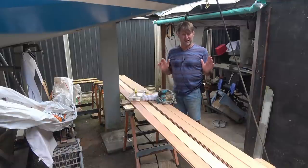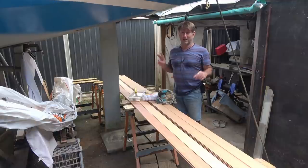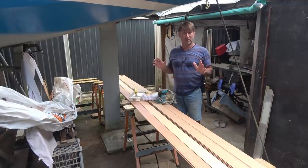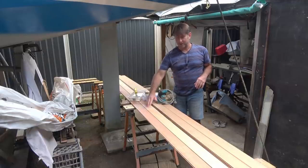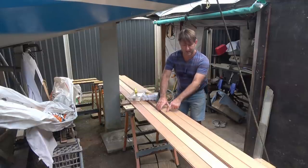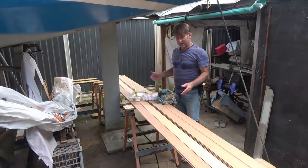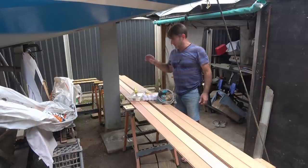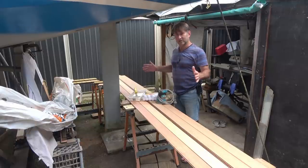Okay, well, the game plan here is that I'm not going to do too much for the first go because, well, a couple of reasons. I just want to get the hang of it, so I don't want to do too many at once. But also, we have had a few days of showers on and off, and today's meant to be the same. So what I'm going to do here, although you only see four strips there, there's another one underneath this one. And so what I'll be doing is I'm going to sand both top and bottom, brush them off, wipe them off with a damp cloth. Then I'll be using the Dulux one step, and then I'm going to roll it on. I think it's a good game plan because I can get five done full lengths in one go.